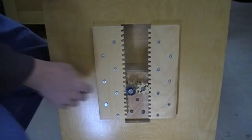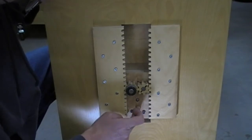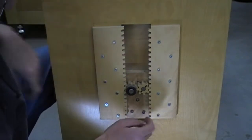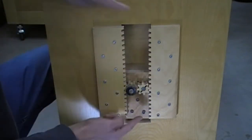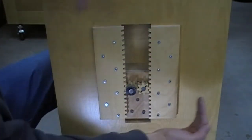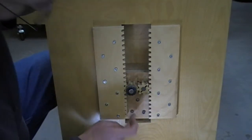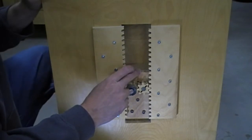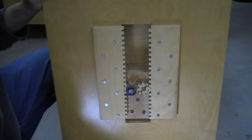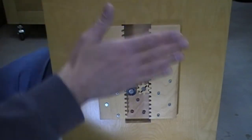Here's a shot from the end of the cabinet — it's a little hard to see with the gears and racks in the way — but there is a rectangular piece of three-quarter inch plywood attached to the base of the cabinet. It rides in an equal-width slot in this outside piece, and that basically keeps it from racking and keeps it aligned so the gears engage correctly. A couple of loose screws I need to tighten, but that's the only thing that holds it — it's not captured in any way other than the stiffness of the three-quarter inch sides coming down around the cabinet.